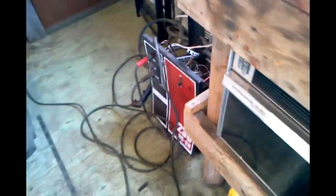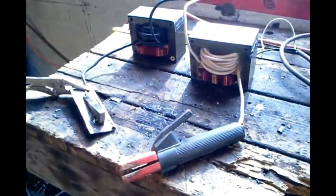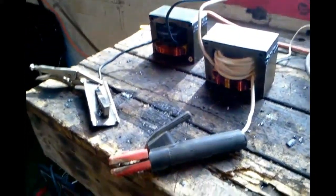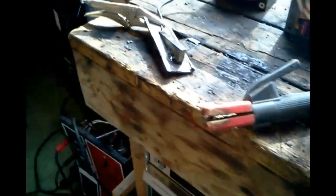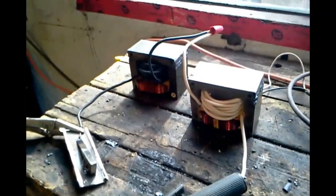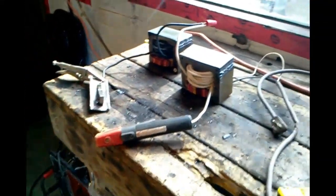Okay, I tested it and that welder is putting out 75 volts and this one I'm putting out 50 — so a little bit under what you'd expect from a big welder. Like I said, it's a homemade welder, and it can weld with these type of rods, these 7018s. So I'm impressed. I'm gonna make longer wires, put them out, and make a little box for it to fit in so you can carry it around and weld stuff.